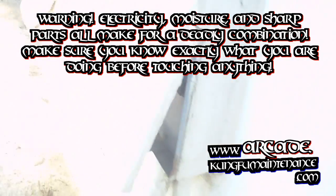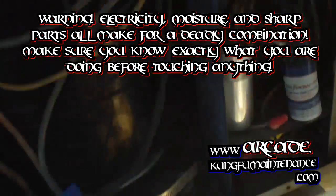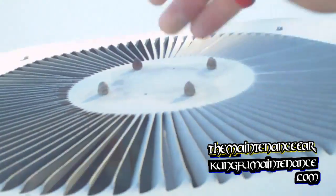We've got an AC not working. I already replaced the fuses and checked it out — we've got power but it's not working. The compressor's not hot and the top of the fan motor's not hot. That leads me to look at the contactor, but the contactor is just fine, like brand new. So I think it's actually our capacitor.